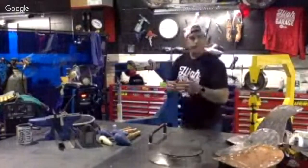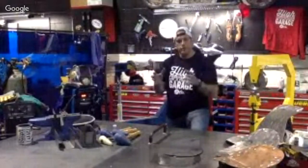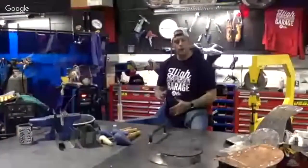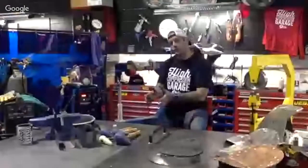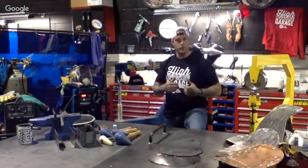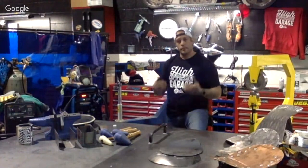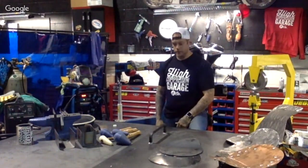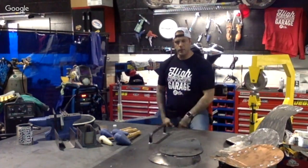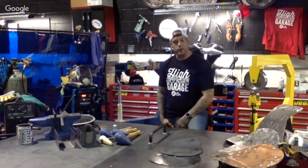So just to recap and give you guys a rundown on some of these tools, there is a nice little package that I guess we could say right now that you could bring to your garage if you're trying to start to get into the trade of fabrication or craftsmanship, or even just try it out. You can get a set of teardrop mallets, dies, and a sandbag, and that'll get you going. And then also look at the benchtop English wheel, the box, sometimes you can call it a sheet metal brake, and then also a shrinker and stretcher. So those are good little pieces to have in your garage and even tinker around with. You never know where this could go. But I'll tell you what, from experience, fabrication on motorcycles will definitely make your bike unique and give you a sense of pride and craftsmanship in doing that.